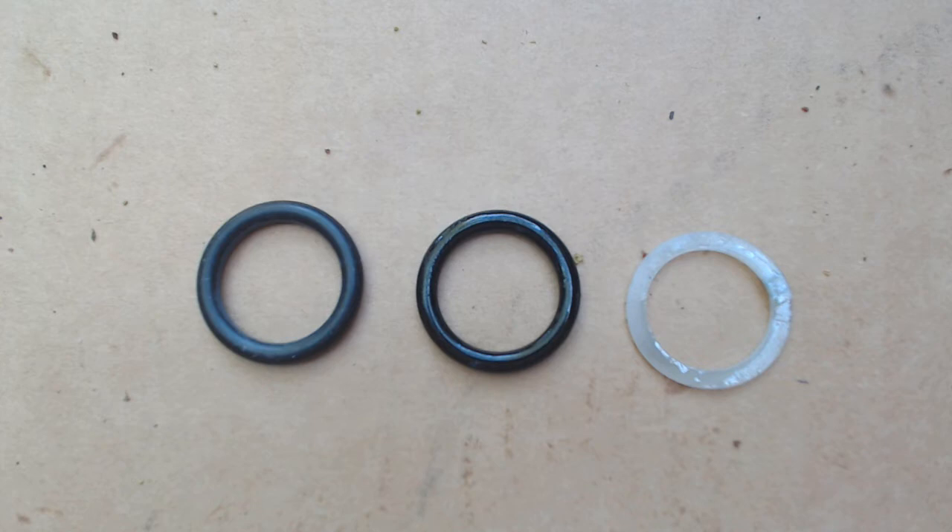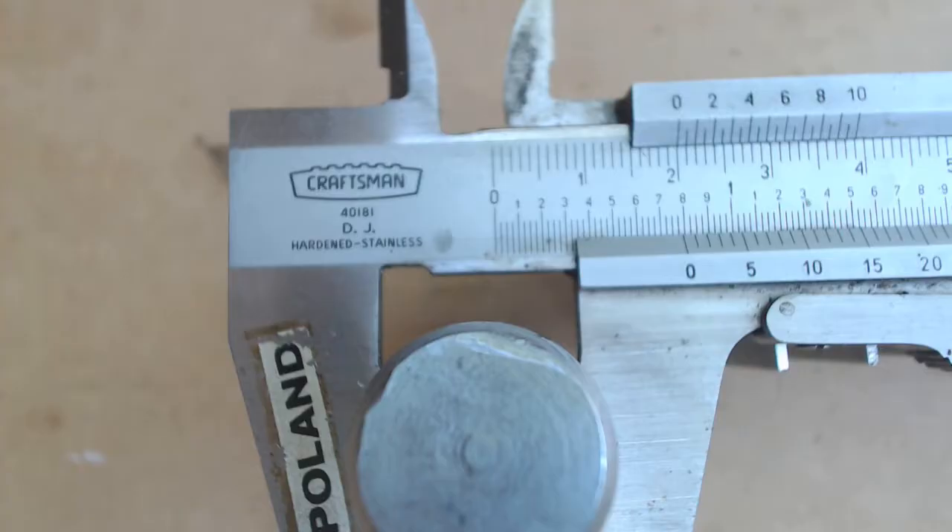If you look real carefully, you might be able to tell the metric o-ring has a slightly larger outside diameter and about the same inside diameter. Now it's time to test fit the o-ring on the actuator. Insert it over the actuator and it should be fairly tight. I do it with both the actuator and the o-ring lubricated. You should be able to slide it up and down with some friction - at least somewhere in that two to five percent compression range. I generally prefer to have the o-ring expand into the bore and seal the bore off.